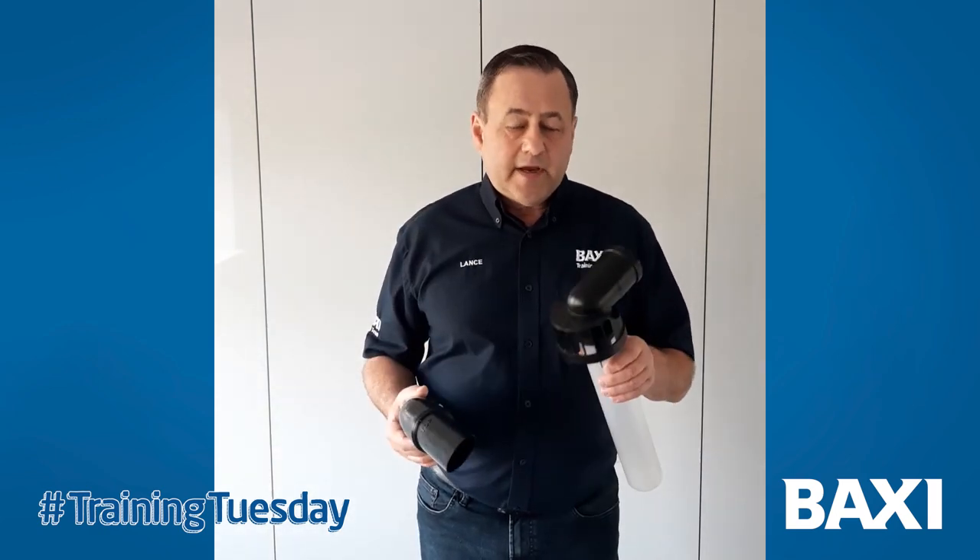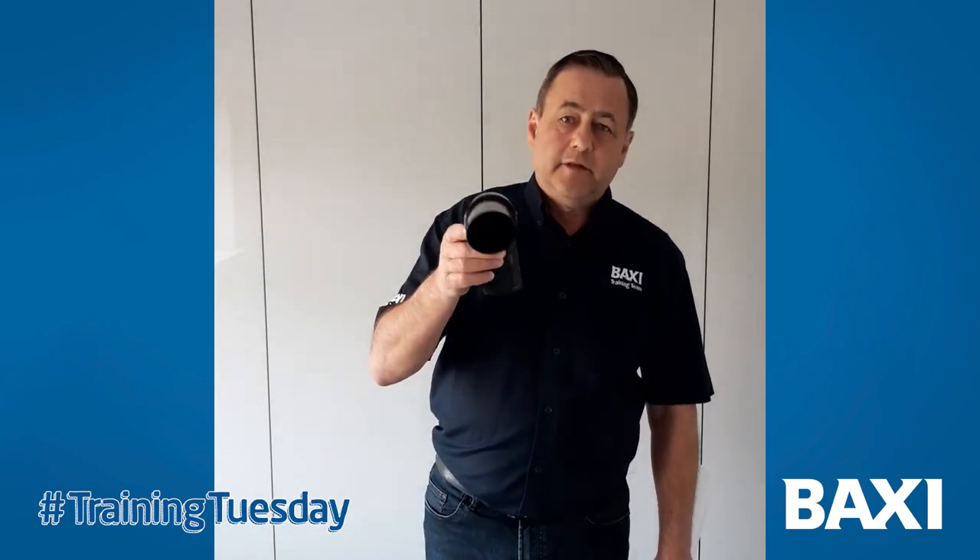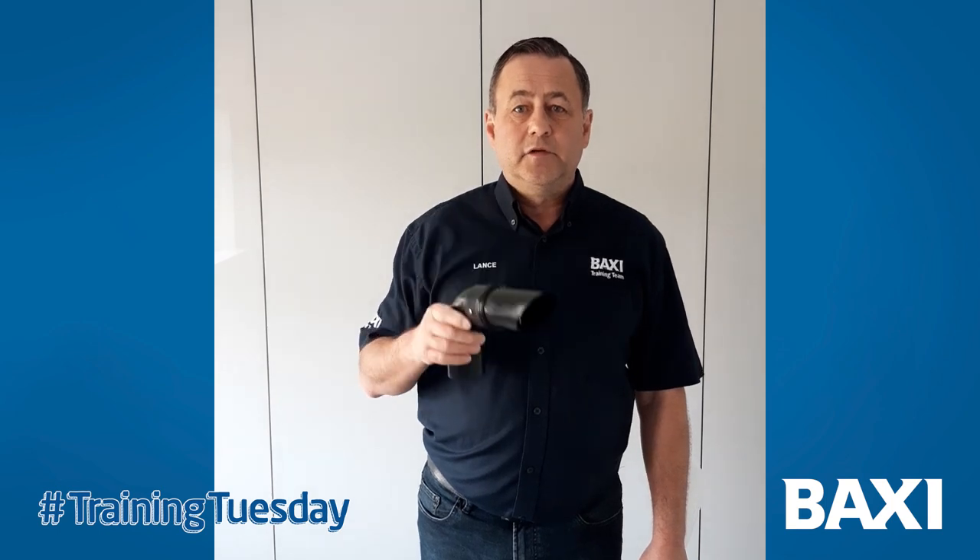This terminal and this air intake do have to be in the same pressure zone. In other words, you can't go around corners or through possibly a carport with your air intake underneath and your terminal above. If you want to do that you'll need an additional part.